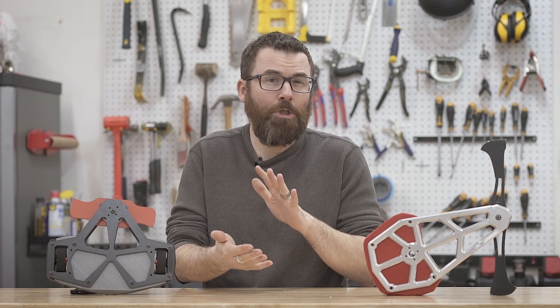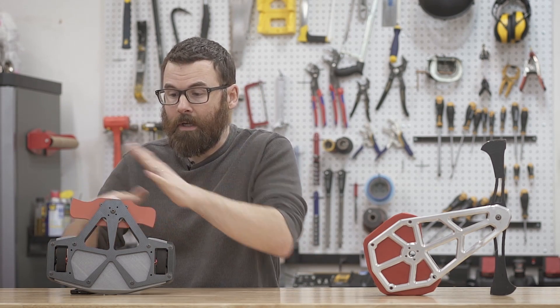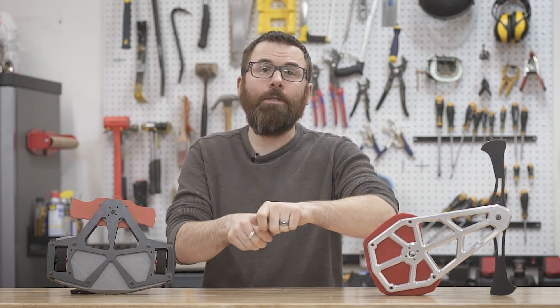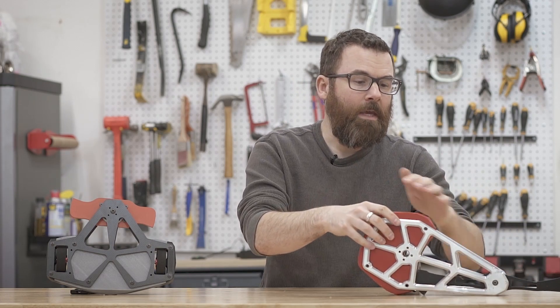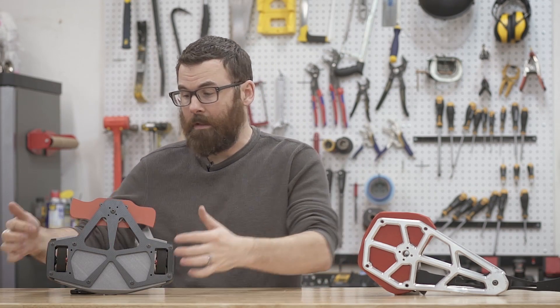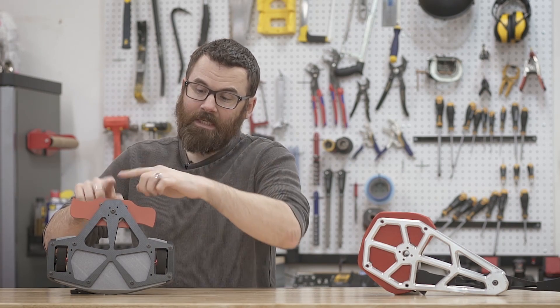There's some material difference and some geometry difference. The biggest difference between these two is that version 2 has been shrunk down and made a lot more compact, because version 1 had a real issue with driving — it was just so long. The weapon blade is just so far out there; this thing is like 18 inches tall or something. So the length made it very difficult to drive and maneuver. This one just got a lot more stout. Interestingly, the wheelbase is actually identical to version 1 — the wheels sit the exact same distance out. I basically just cut six and a half inches off and added the wheel guards on the side.